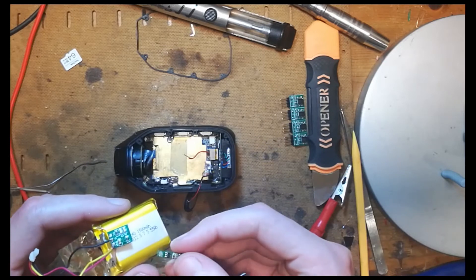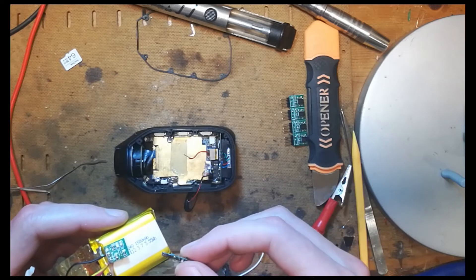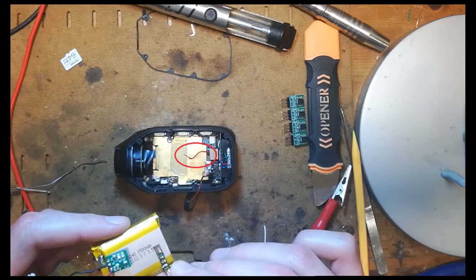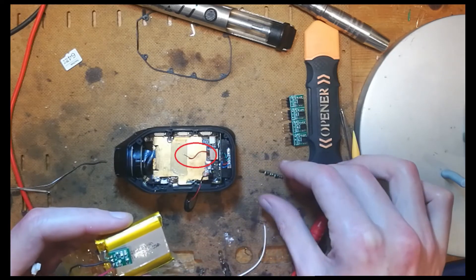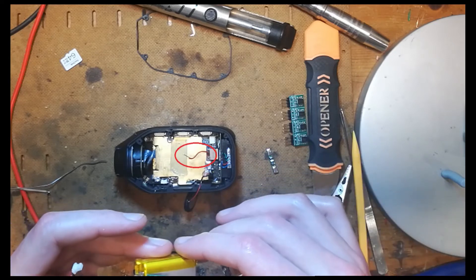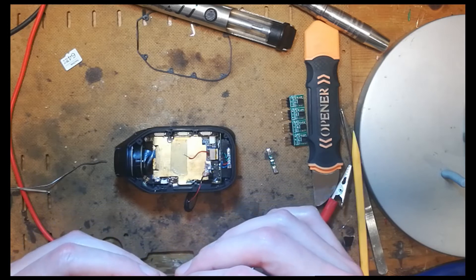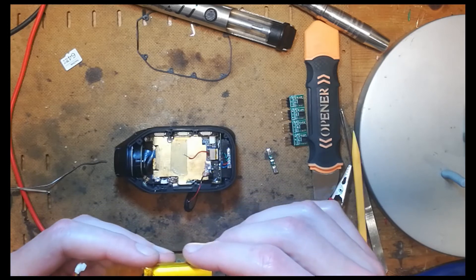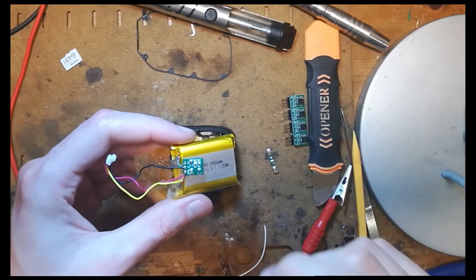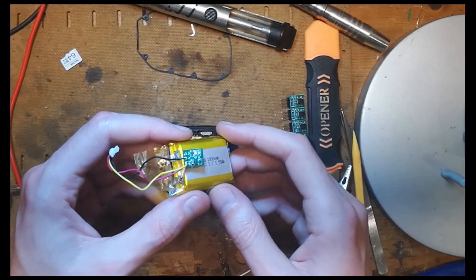Because I had already taken out the circuit board, I decided to connect a wire to the five-volt pin of the USB port and route it underneath the heat sink — the interference shield — so I'd have five-volt power in that area. You could potentially find another component with over 4.2 volts near the battery connector and use that for the same purpose, which would also avoid having to pull out the whole circuit board.